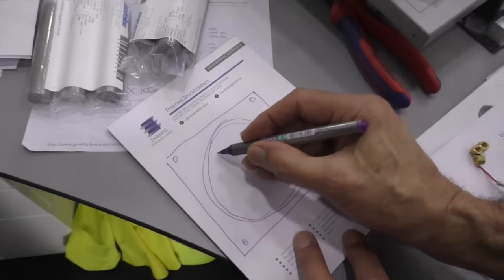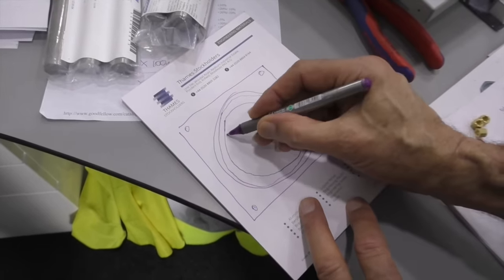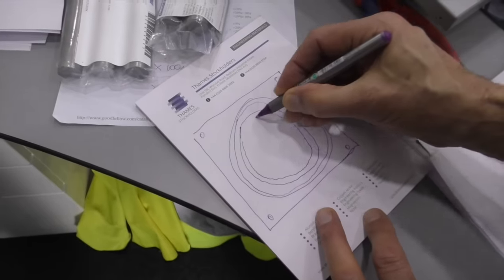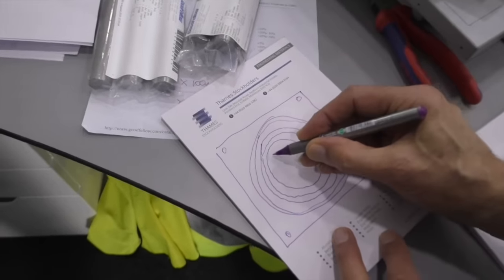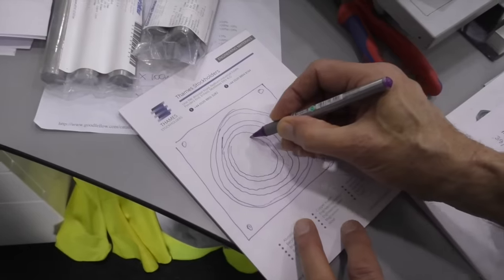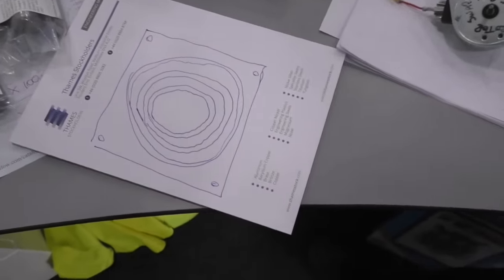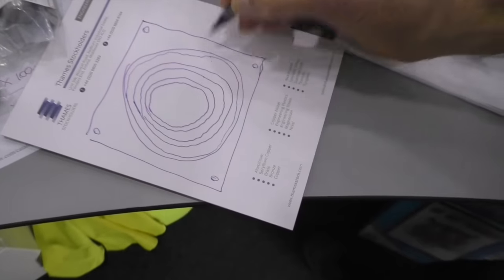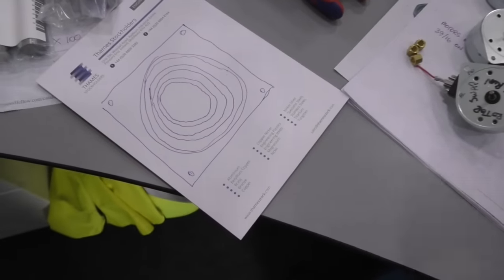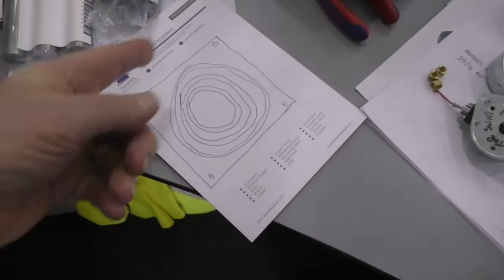What they actually do to make it commercially viable is put another ring in here, so they can make ten different sizes at the same time. These are British standard sizes — you can just phone up and get O-rings tomorrow from a local supplier, plus or minus three thousandths of an inch. Then they pour the material. The rubber looks like plasticine. These are standard O-rings.